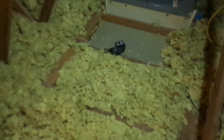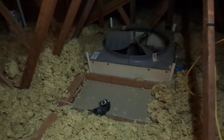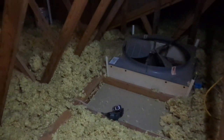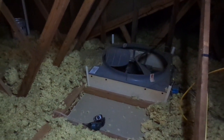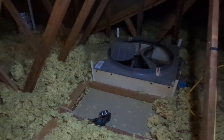I don't know how much of this is going to get on camera, if any of it at all, because it is not pleasant. Here we are getting ready to start the preliminary install of that heat pump in my son's attic. You can see where we're going to actually put it. That's going to be the return air coming up through there right next to the attic fan. We've got to build that attic fan up about 18 inches all the way around because we're going to totally encompass the supply air duct.